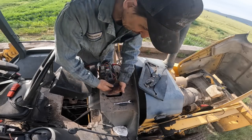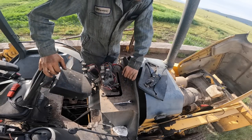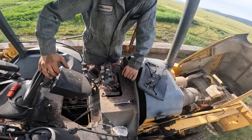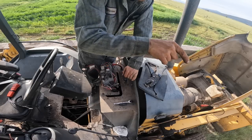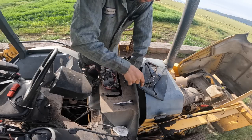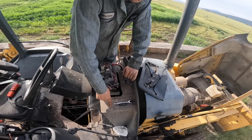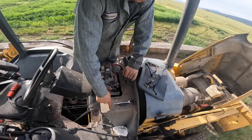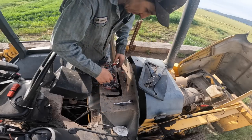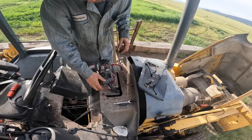So I went out there last night before it was getting late, and I pulled the pressure line off the saw head, the line going to the saw control valve up on the Temco head, and I capped it, and then the leveling worked. I said, we have a problem back in our saw leveling valve. One of these cartridge valves is sticking, and it's not shutting the oil off. It's supposed to block port A when you activate the leveling valve, because it's combining the flow, and it's not doing that. It's not shutting that oil off to the saw. So I've got to go back and finish that one too, but we've got to finish this one too.